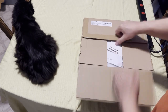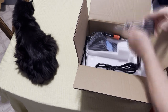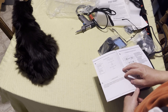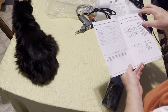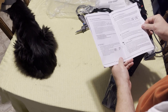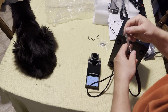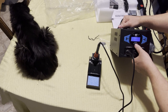Now it's time for our new budgeted item for 2023. I ordered a soldering station suitable for vintage computers. This includes a soldering iron and a de-soldering pump. I didn't get the one with the hot air gun as well — I figured that might be a bit much for vintage machines — but I'm going to read the instructions very carefully. Among other things, I'm supposed to do the initial heat up to 250 Celsius, and then I can tin the tips with a tinning paste that came with the kit. I can do this for both the soldering iron and the de-soldering pump.